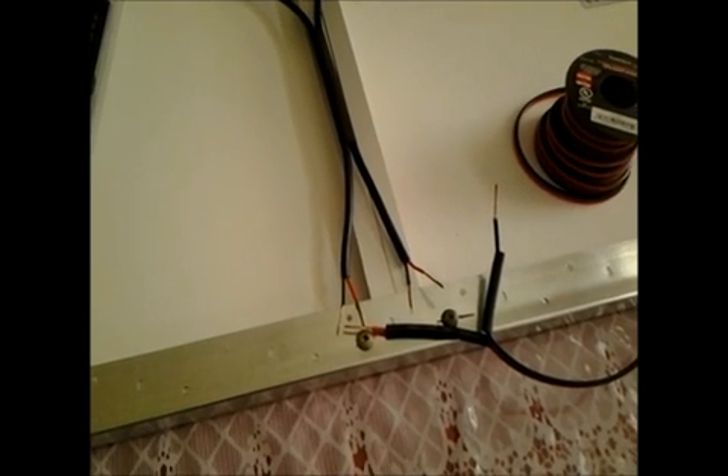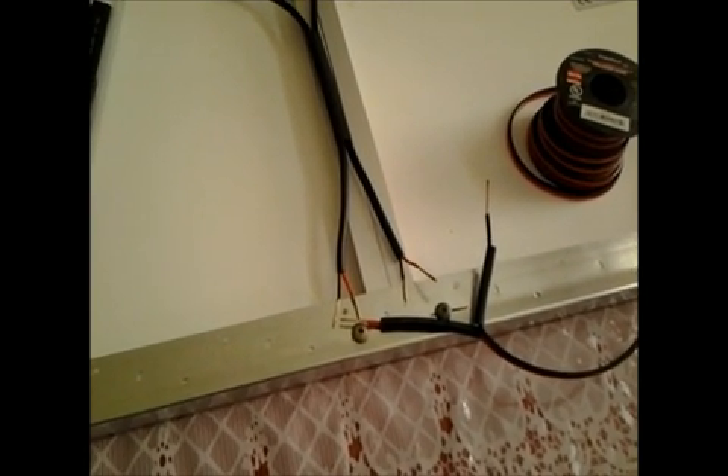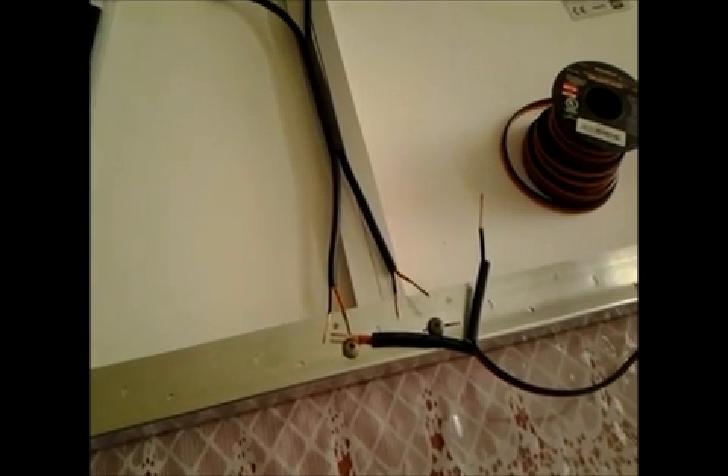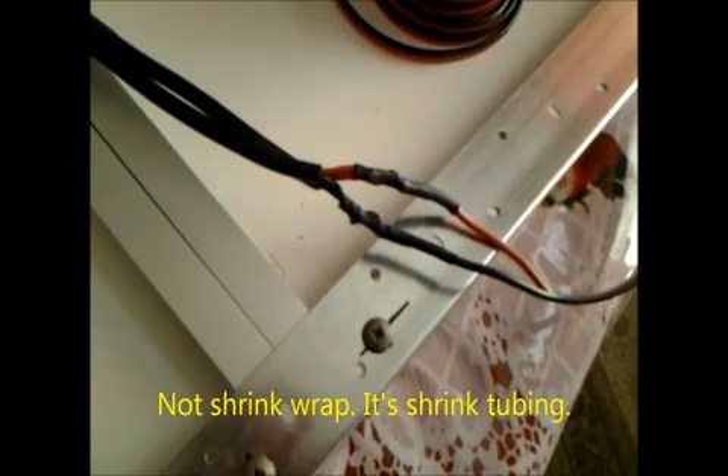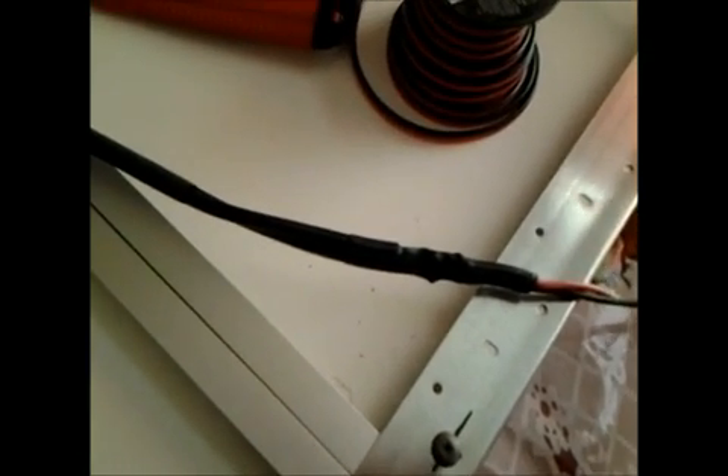This is going to be up on my roof very short term and it's basically just for testing — this is not recommended to do it this way. Here you can see I've got them tinned, my connections. And here I've got shrink wrap covering where I joined those wires. There's shrink tubing covering the whole thing where I got it all connected, so it's reasonably waterproof and fairly strong.